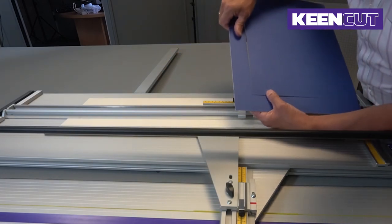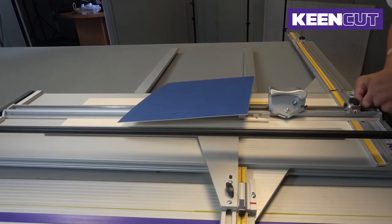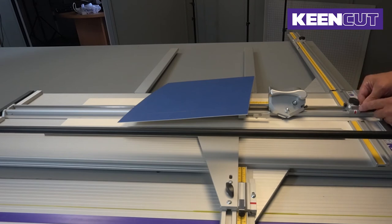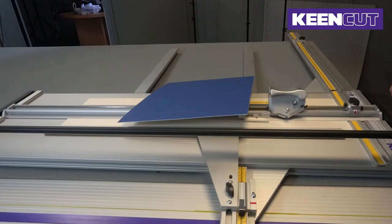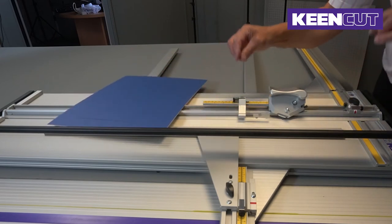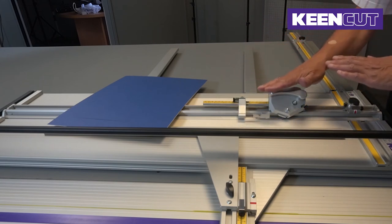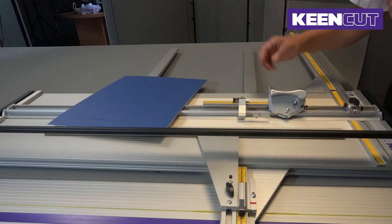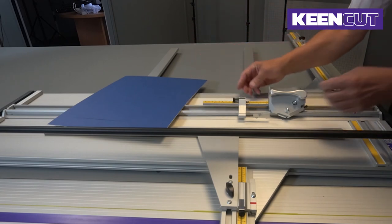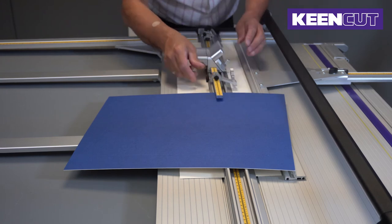Our end of cut — I think that is over-cutting by a bit less than a millimeter. As it's over-cutting, we want to reduce the cut, so we turn this in the minus direction by about three-quarters of a millimeter. Now we have calibrated the stops, but we need to reset them because they're still in their old position. If I made the next two cuts with these in this position, we'd get the same results. So I need to reset this to five and reset this to five.